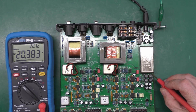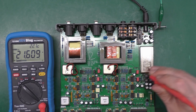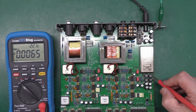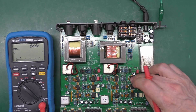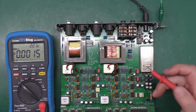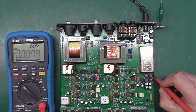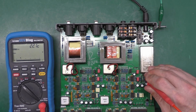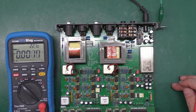I'm going to take the DC-to-DC converter out and try it off-circuit. Also worth noting: the rails are going up to minus 21 and plus 20 volts — these NE5534 op-amps are only rated at plus-or-minus 20 volts, so 40 volts across them. We're at the limit for those op-amps. Minus 21 — my god. I'm taking that DC-to-DC converter out and testing it off-circuit.